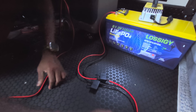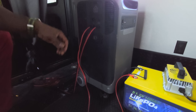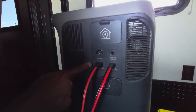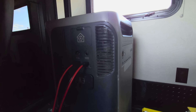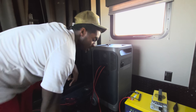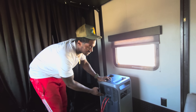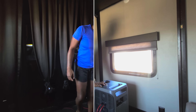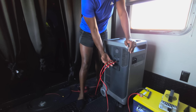You simply connect the Anderson cable — it's a two-part system. You'll also need the Anderson cable that is compatible with your solar hookup. For us, that's the XT60 cables. It's a simple plug-and-play solution. What you're going to do is hook that up and plug it into your solar intake port. So we have our connections set.